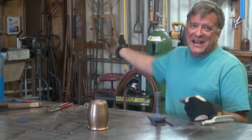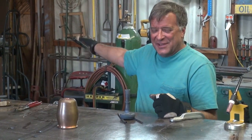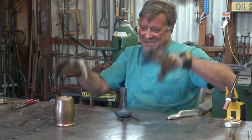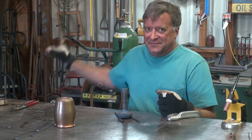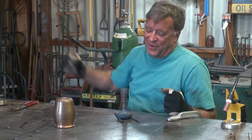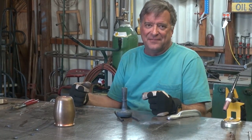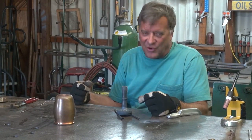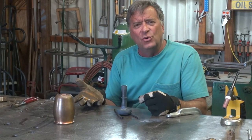I thought about getting the oxygen acetylene out, but then you've got the torch, the flame, the gas, the TIG — doing it all one-handed as just one person. So I left that out of the way for now. I got it up a little bit with the propane, and then just sat here with 255 amps, warming it up. It kind of acts like aluminum, really — it takes a lot of heat, you've really got to get on it.